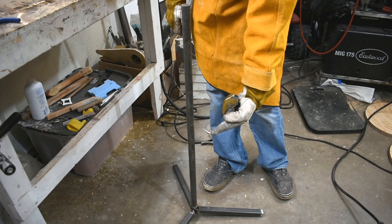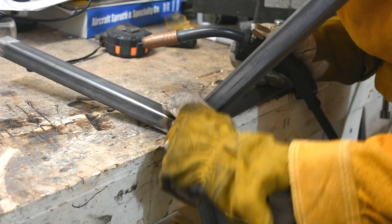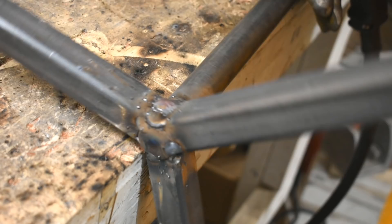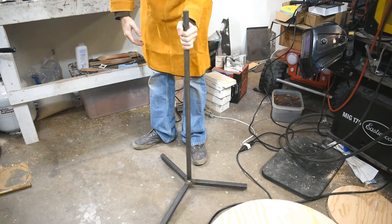I don't know how I'm going to do this — probably just going to fill it up with wire. This bar is solid and these are only eighth inch thick wall, so there's a lot of wire I need to fill in there to connect them up solid. Starting to burn back on the square tubing. It's ugly, but it's holding. Those welds may look terrible, so I have two choices: grinder or ignore it because you're not going to see it. I choose choice number two.